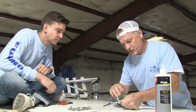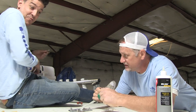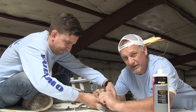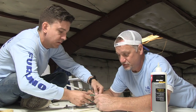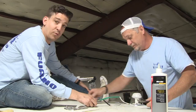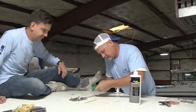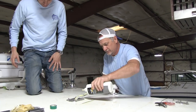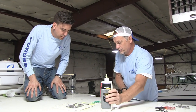We're going to tape this new messenger onto the existing Furuno radar DRS cable. Hold it tight while I tape it — get a good long pull because we're not sure how tight this cable is in the run. If you have a tight one, make sure you secure this rope; you do not want it separating and leaving the messenger halfway into the tube. Now we're going to lube this up — just your generic wire pulling lube. It doesn't hurt to have too much. Pull it right into the cable too and make sure you get it on the cable, and then we're going to go down and start yanking it through.